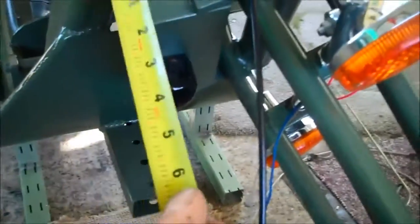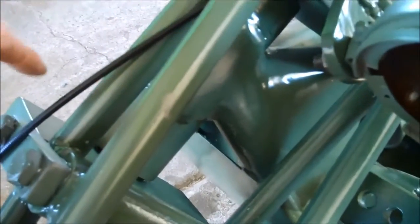The triple trees are — this set is three inches by one inch by exactly seven inches wide, and that's just the overall width of the front end. The centerpiece on this part of the front end is inch and a quarter solid stock, seven inches. This one up here is one inch by seven inches. You have to make sure that this piece and this piece are the exact same width as your triple trees — all of those pieces have to be the exact same width.